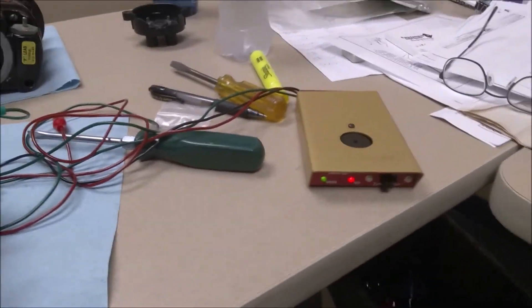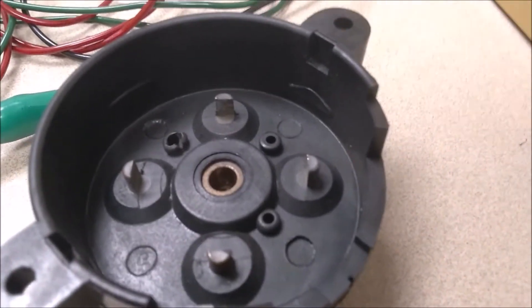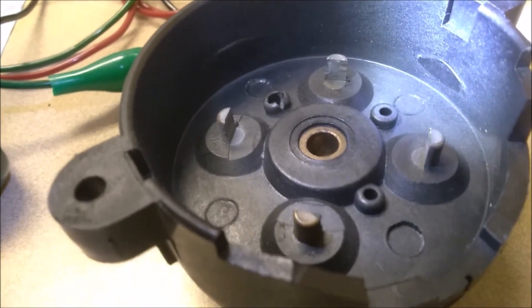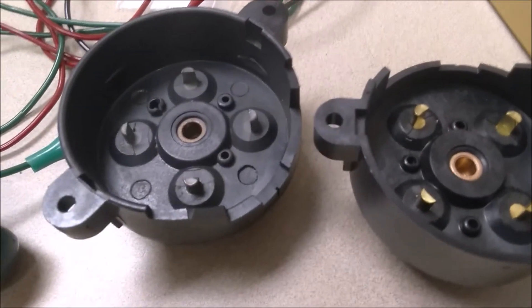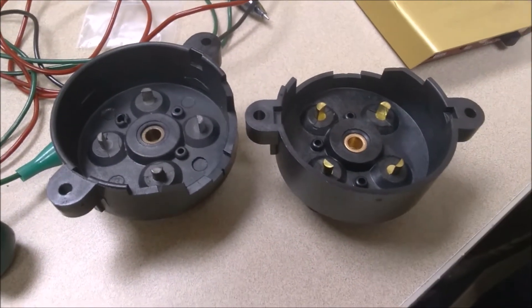Next thing is take it out and put it on the airplane. Don't remove the rig pin until you got your mags installed, then you can pull your rig pin and hook up your buzz box again - that shows you how close the rig pin gets it, just a little bit of play. Here's why I decided to replace my distributor - it's very hard to see, but over on that corner, see that burn in there? I must've just replaced that. Also, look at the difference between new ones and old ones. I really don't know how many hours are on this mag - I got this plane from my uncle and I'm doing an annual on it, so I decided to just go ahead and do a little preventive maintenance on the mags.